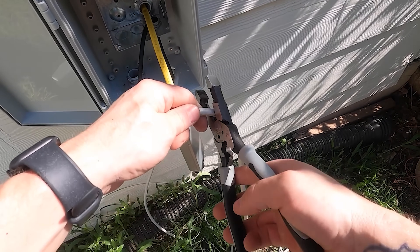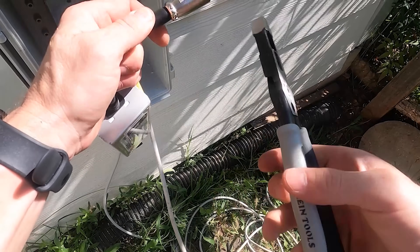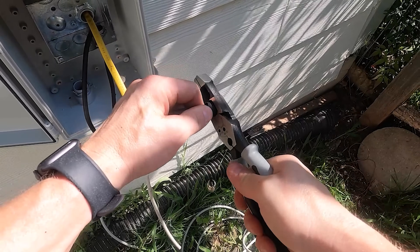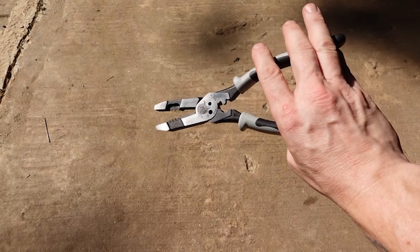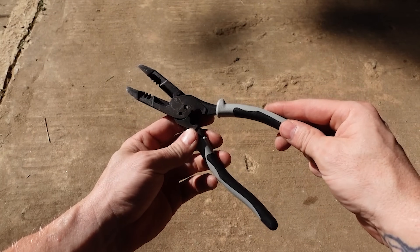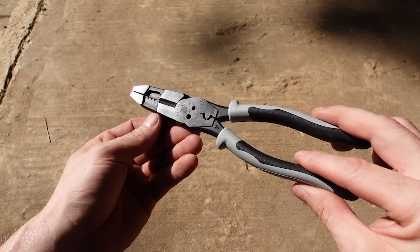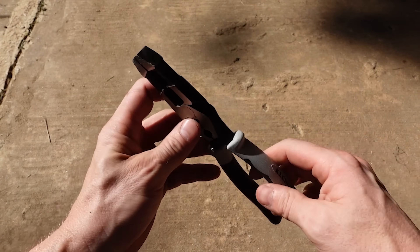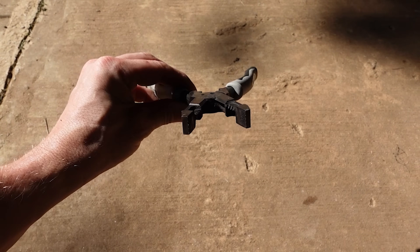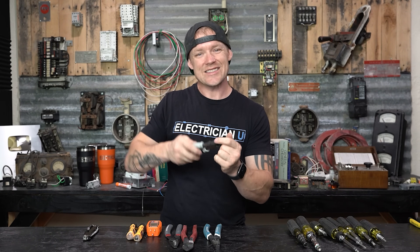Other than that, it's got three different size strippers — for solid it's got 14, 12, and 10, which are the three sizes you're probably going to use the majority of the time. I like that it still has bolt cutters: 6-32 and 8-32, and it's got a little inside crimper so if you're using butt splices or crimp sleeves you can crimp them. Making joints and twisting wires is a little bit different — that forward hand position and the lack of leverage means you can't twist joints as tightly or as neatly, so it's taken me a little bit of time getting used to.